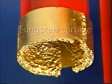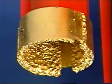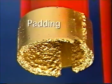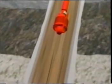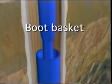Its custom-made tungsten carbide-faced shoe is dressed to near casing ID, so it cuts only the slip section of the packer. Padding above the shoe prevents damage to the casing wall. The retrieving assembly, with a correctly selected grapple for the packer bore, is run below hydraulic jars, collars, and a boot basket, which collects metal debris cut loose by the shoe.